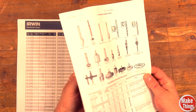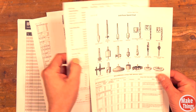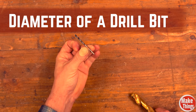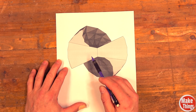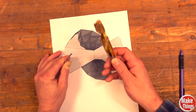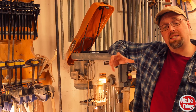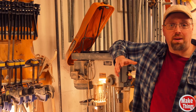There are countless charts out there that show exactly how fast a drill bit needs to go. I printed the top 10 results I got on Google. Basically, there are two different deciding factors: the diameter of the drill bit and the type of material used. I made a chart of the top six best results I found, averaging their suggested speeds and then rounding them to the nearest speed that my drill press will do.